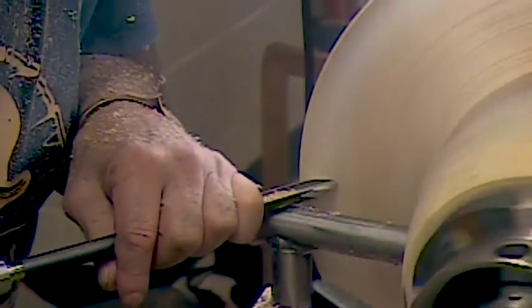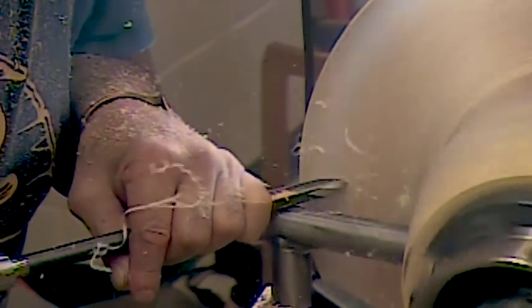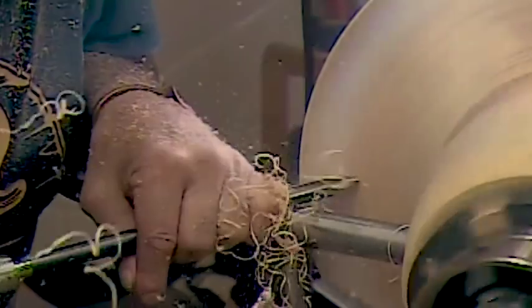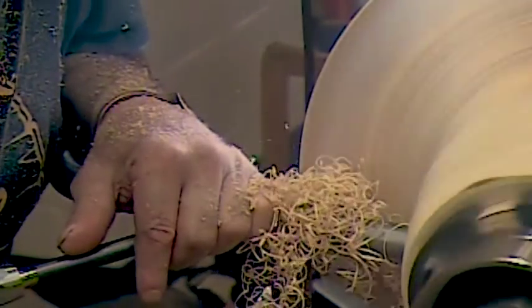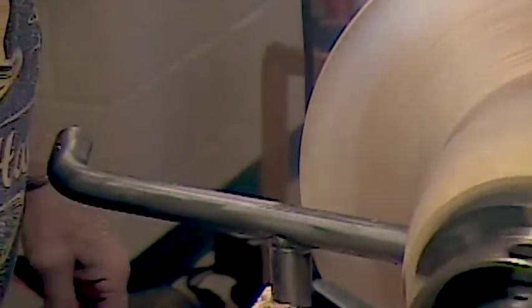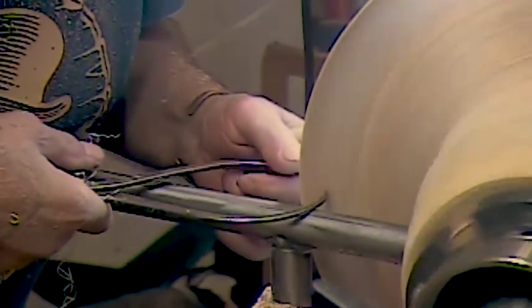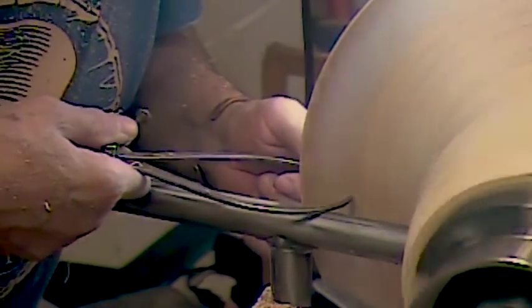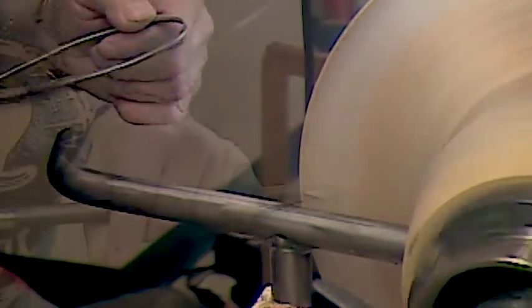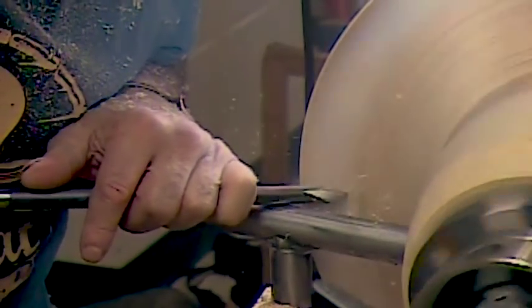From here, push a cut and make it become a 16th. Didn't quite. Let's do another one and make that become a 16th. Now I'm worried that I just need to measure again. So I pick up the thickness where I liked it. I go in and it starts to rub right there. So I need to do just a little more of the same. Here I'm using the side of the tool, pointing the tool downhill, getting a sharp part of the tool.